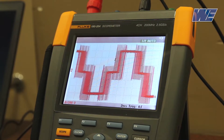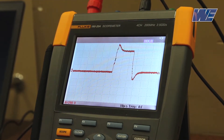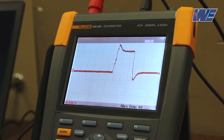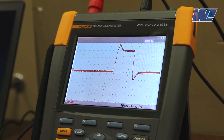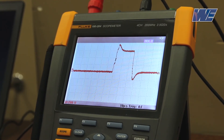Now I'll expand out to look at one pulse. Here's one pulse. You can see that the peak is getting up to about 800 volts. The rise time is still much faster than with the output reactor, but we have attenuated the large overshoot on the voltage. Also, you can note that the ringing is significantly less with the DVDT filter than with the output reactor.